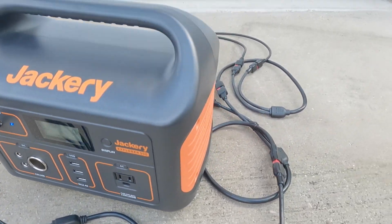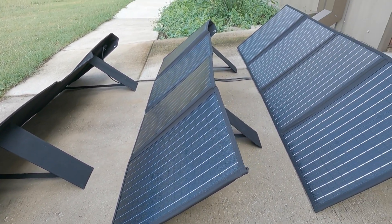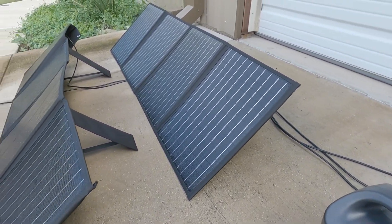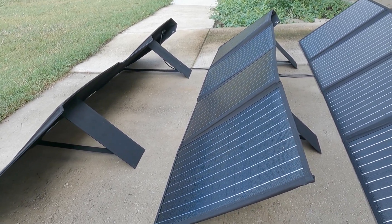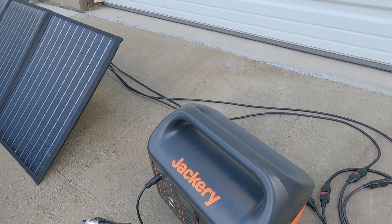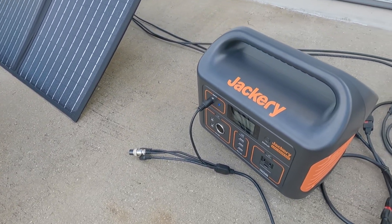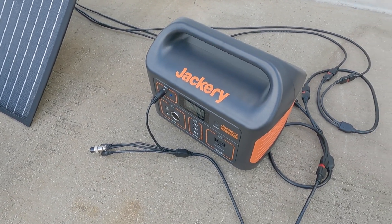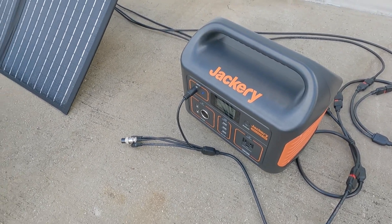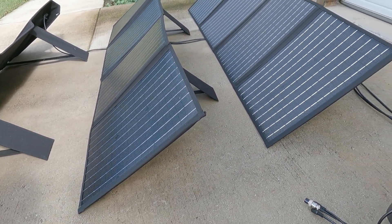Will it charge it? The answer is yes, you can run three of these things together. My guess is the reason they don't talk about running three together is because you don't want to end up running too much current. When you parallel these things, you're increasing the amps and you're not increasing the volts — the volts stay the same. These wires are probably 14 gauge, I'm guessing — they're not real heavy duty. This Jackery is not going to suck in more than about 75 watts in optimal conditions, even though these solar panels could put out way more. If I had an EcoFlow or something that can suck in a lot more power, it may become more of a problem, and it would be better to tie some of these together in series to increase the voltage and keep the amps consistent.